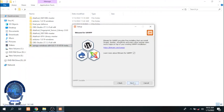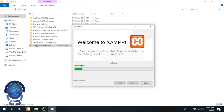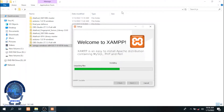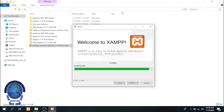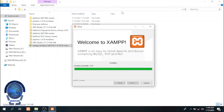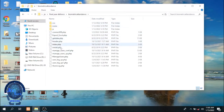Beginning with IoT stuff locally, you start by installing XAMPP on your PC for running the project, and once this process is successful, then you are ready to go ahead with an external server. Once XAMPP is completely installed, you'll need to download the two folders that I shared in the description. One of them is biometric attendance that I need to copy to htdocs.